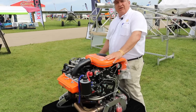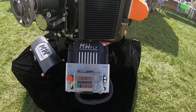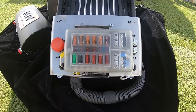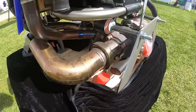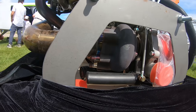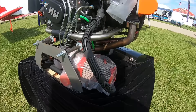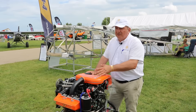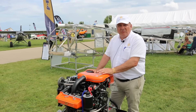You can also get an MW Fly hub and blades for a complete prop solution — constant speed, hydraulically controlled, with their own prop governor. Additionally, you can get the MW Fly engine monitoring module, or it can talk CAN bus to any EFIS or multifunction display, or you can do both — have the engine monitoring glass inside and still send information to the panels. Under the Sherwings program, these are the only two engine options. However, you can build a BD-4 with pretty much any engine you want as long as it's appropriate.